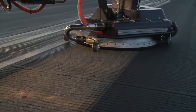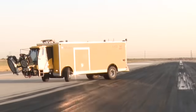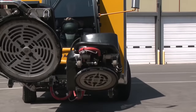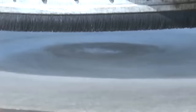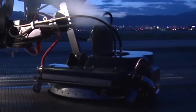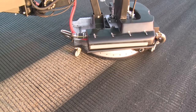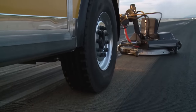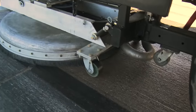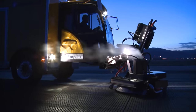That's why machines that can remove skid marks are used. The main feature of this machine from Nilfisk Advance is that it can work very quickly — often workers only have a few minutes to clean a runway. This cleaner is powerful enough to even remove markings without damaging the runway surface, which is especially useful when the lane hasn't been cleaned in a long time and rubber has begun to destroy the markings. The secret of the cleaner's efficiency is a nozzle that blows air at a speed of 217 kilometers per hour — an impact comparable to a category 4 storm, enough to remove all dirt.